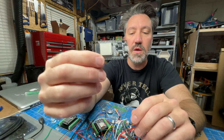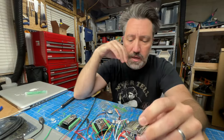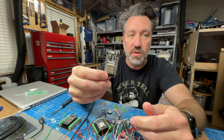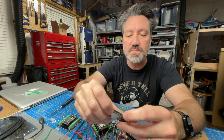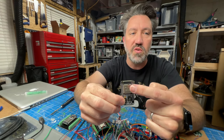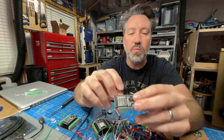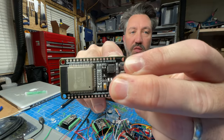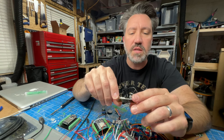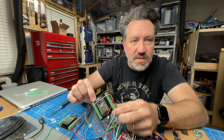There are a few differences, most of which you won't need to worry about if you follow the published DIY plans. The key thing is: we're sending five volts in, getting 3.3 volts regulated by the board for the chip, and we'll make use of the 3V3 pin for some accessories. Despite having so many pins available, not every pin will be used.